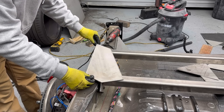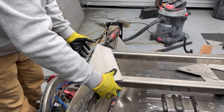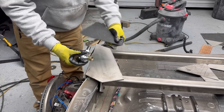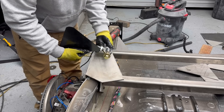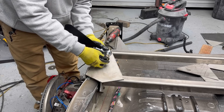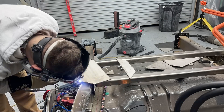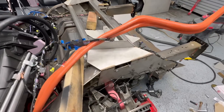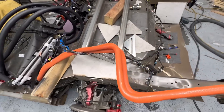This goes here — I'm going to tack weld it wherever I can, weld it up here, then take the whole setup off and weld it from the back. For the cantilever I'm going to use two of these — fat five-eighths grade 8 bolts — one standing like this, another one like this, butted up against each other. Not too shabby of a welding job. That's where I'm at for today.